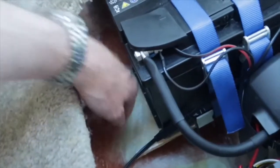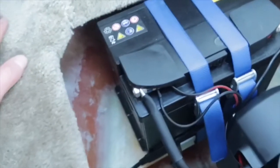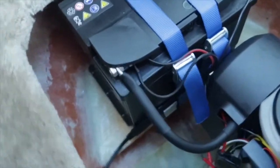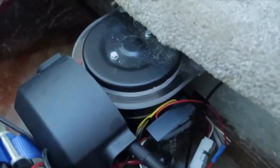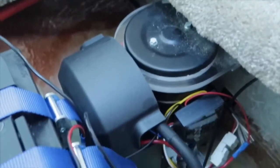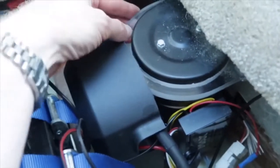The battery is mounted on this plywood bracket I made — it's glassed in on top and bottom, so of course everything is glassed in nice and secure. The thruster itself sits on the tunnel, and the instructions suggest that you make some kind of bracket up here to support it while underway, so you won't have forces tilting the thruster back and forward.